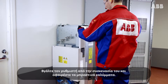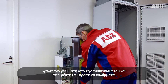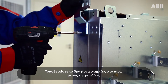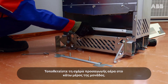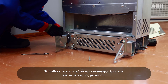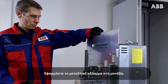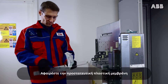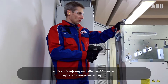After unpacking the drive module, remove the front covers. Install the mounting bracket to the rear part of the module. Attach the air inlet grill to the bottom of the module. Install the metallic shroud. Remove the protective plastic film from the clear plastic back shrouds before installation.